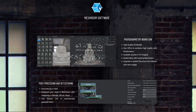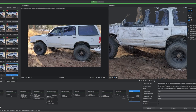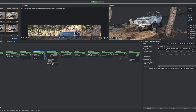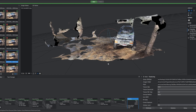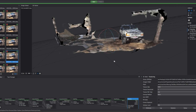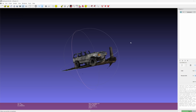There are two different photogrammetry softwares that I would recommend. The first one is open source, it's entirely free, and it's called Meshroom. It's a node style interface where you work through each node one at a time in order to get to the final product. The only issue with it is that it's a little slow, and if your model doesn't come out right the first time, every one of these nodes has about a dozen different parameters you can tweak, and it can be really complicated to get your model just right. Sometimes it comes out perfect the first time; sometimes you have to do a lot of fiddling. Additionally, if you need to adjust your model at all — like removing the background and keeping the car — there aren't native features to do this in Meshroom. You'll have to pull it out into a different software like MeshLab or MeshMixer in order to do those modifications.